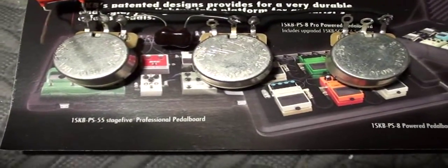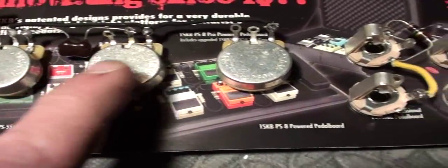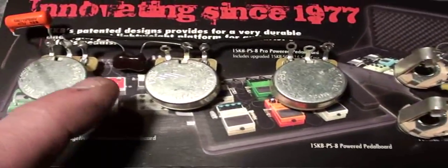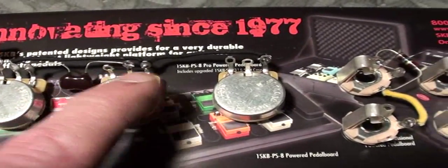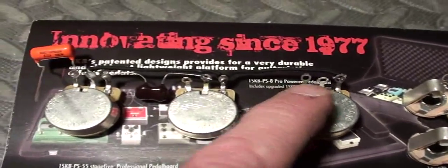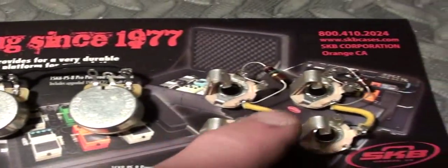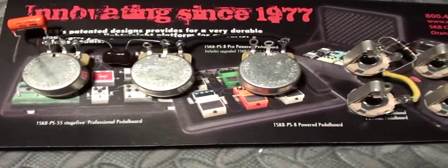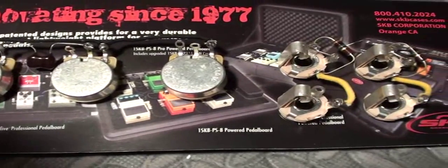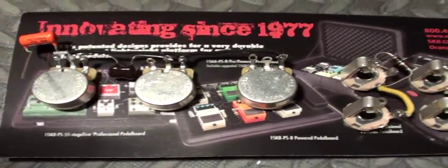As far as my grounding goes, my grounding scheme — I'm going to be using a separate run between the components and the board, which will connect both the board grounds and my grounding terminals off of the pots and my cap. That will help separate the preamp stage from the power stage, and we'll see that a little later on when I do other updates.